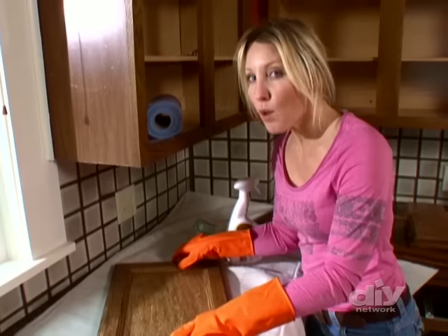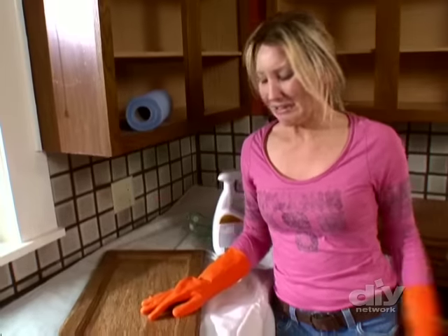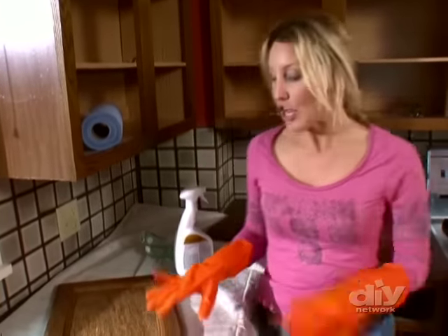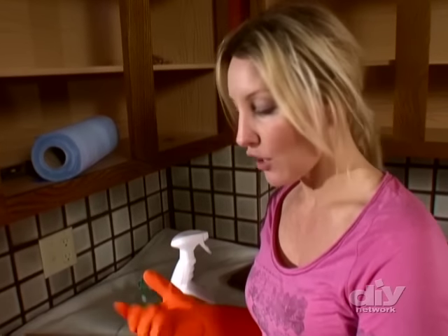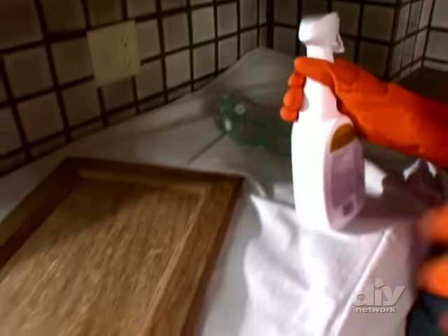The next step is probably the most important — you're not going to get a good paint finish on your cabinets unless they are absolutely clean. In the kitchen, these things are covered with grease, food, probably even some spaghetti sauce. You can use any cleaner you want, but the most important thing is you don't want to use a cleaner that leaves any residue on the surface. Most people are going to use TSP — trisodium phosphate — it comes in powder form, you mix it with water and put it on the cabinet and it takes off all that grease.